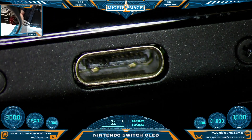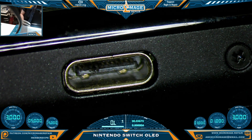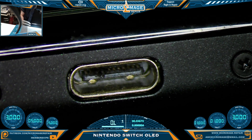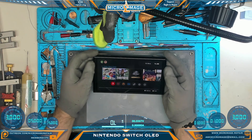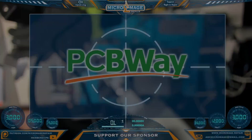OLED - let's see if we can figure out what's going on. Straight away we can see a little nick in the port, and that is actually a bent pin that is likely making contact with the pin next over. We're not going to plug power to that at all. See if it'll power up - it does, so it still works. That's good news. We're going to have to disassemble entirely, change the port, and test from there.